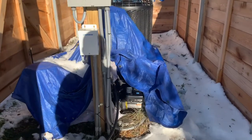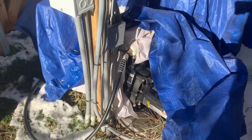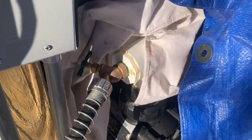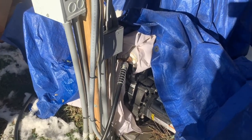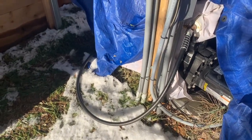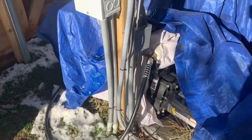Here's where the filter and pump are. The pump has a spigot on it that you can put a garden hose on, so I put a garden hose on there and opened it up so water can be pushed through a garden hose. Normally this is used to drain your pool when the water's too high from too much rain, but this is the first step.